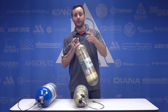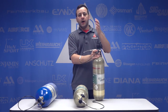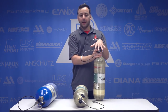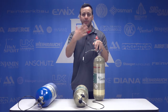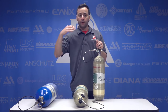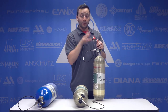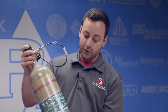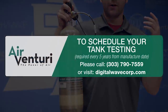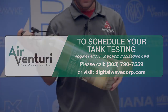Whether you have a brand new tank or a life extended tank, you can go to Digital Wave and have them do the MAE testing. It is considered by the DOT a comparable test to a hydro test, so you can do that on five-year intervals. If you buy a life extended tank, it can only be re-qualified after those first five years by Digital Wave — that's really important. You'll note that Digital Wave's website and phone number are on each tank, so when you approach that five-year period, give them a call to set up getting it retested.